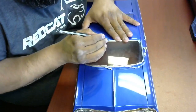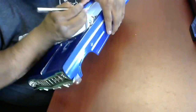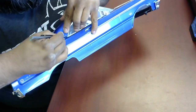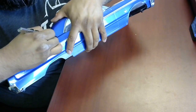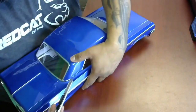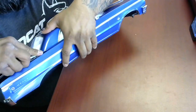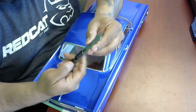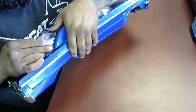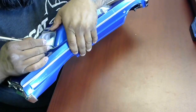Let the blade work for you — you don't have to treat it like a Sawzall. Let the blade do its thing; that's what it's there for. The great thing is they're cheap enough that you can just snap it off and keep at it. Once you kind of get it started, you can extend the blade a little bit more so you have a longer stroke, and now just follow the line that you already made. Remember to retract the blade as needed so you don't end up breaking one and cutting yourself.